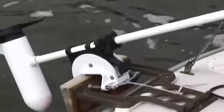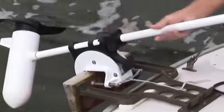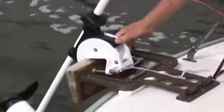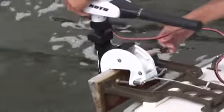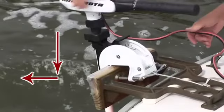Let's review the operation of the electric motor. First, turn the black collar or locking screw on the engine shaft, which allows the motor to slide up and down. While lowering the motor, tilt the shaft by depressing the locking mechanism — which is either a lever or a small black button — until the shaft clicks into place. Make sure the engine is as low as it can go and that the shaft is parallel to the boat or at a 90-degree angle to the water.